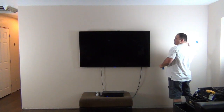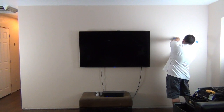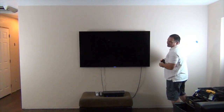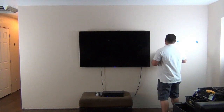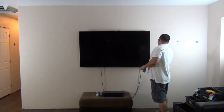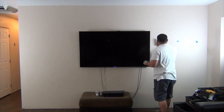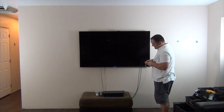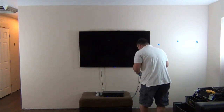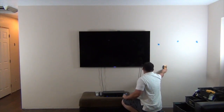In a perfect world, studs will be spaced about 16 inches on center, but you're going to find in your house they're not always like that. They can be less than 16 — that's fine — but code says 16 inches on center. If you have a steel frame house, you'll probably be finding something like 24 inches on center, or maybe 20 inches on center.